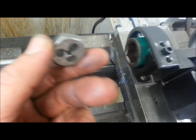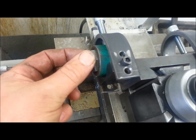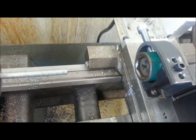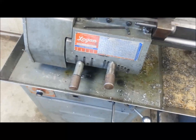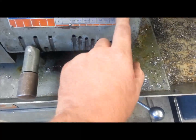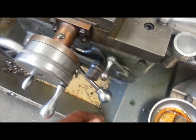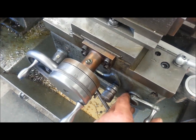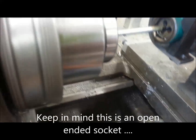We're going to take a hex die — put the lead side facing the rod. We're going to run at low speed. I've got my gearbox set for 20 right now, that's a 28-thread. So I'm on 28B — our thread is going to run in at 28 threads per inch. Get a little dab of oil on the die, run it up to the rod, and then engage the half nut and let it rip.